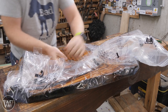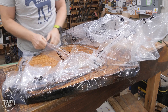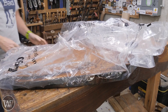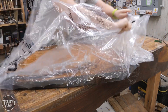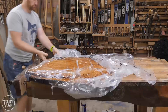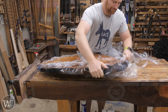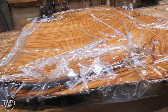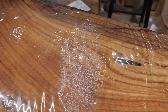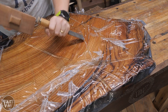I let them sit for a couple days and then peeled it off. The bag actually peeled off the epoxy beautifully. The only downsides were the spots where it kind of tucked into itself — it had many crinkles and curls but we'll be addressing those. The bag itself peels off the epoxy perfectly and it was far easier than taking any tape off on any project I've done like that in the past. You can see the bottom side was really nice and smooth, but there was a spot where it overheated because I had sunlight coming through.